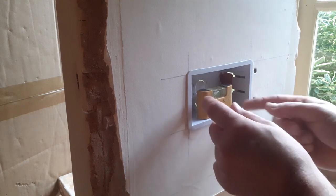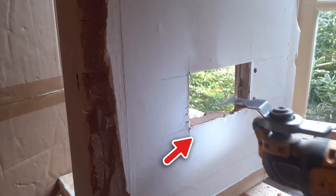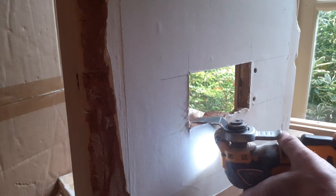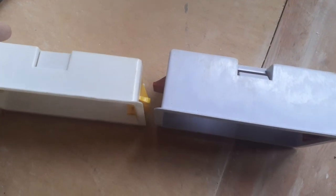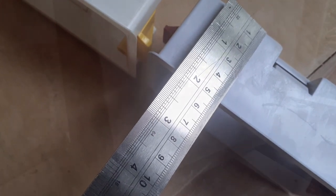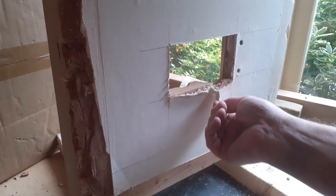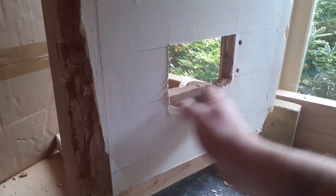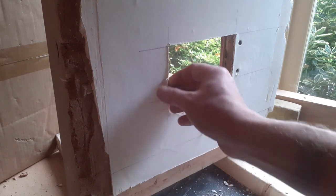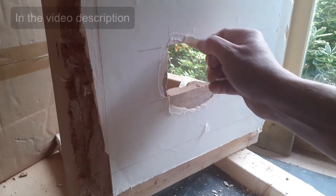It's not quite level here, and there's not a great deal of movement on plasterboard boxes so we need to get it level — just need to nick a little bit off the bottom. The more you play around with it, the more chance the plaster is going to come away. You can see the paper is starting to come away a little bit — I'll show you what we can do about that. Make sure you buy the deep plasterboard boxes — the 47mm deep ones. The smaller size is just too shallow to fit in lath and plaster. When you cut into lath and plaster there's a good chance of getting a bit of damage around the socket. It's so dry that little bits of plaster will fall away — sometimes quite a lot. Don't worry, we can fill that. Get a bit of bonding on it if it's quite deep, or some decent surface filler.